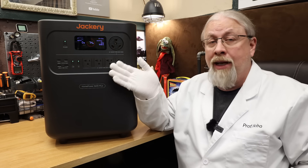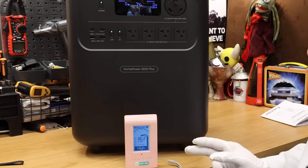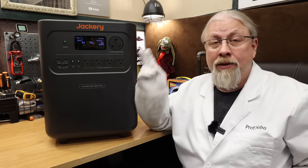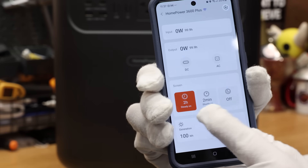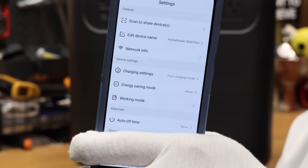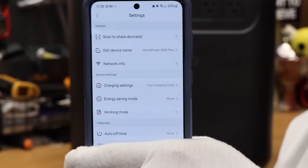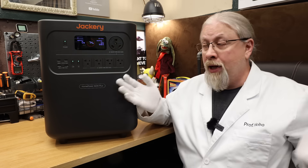The electromagnetic interference test with Wi-Fi and Bluetooth enabled: for DC it was basically baseline, which is low; the AC inverter scored 80, which is high but not out of the question. As for the extra battery test, Jackery didn't supply one so I couldn't test that. The app shows input/output watts, and scrolling down you can adjust the screen timeout, change charging settings, UPS settings, auto-off times for inverter and DC modes, and access firmware updates. That's literally all there is to it.